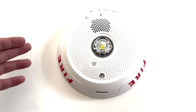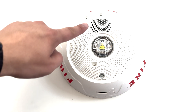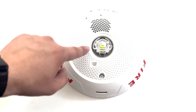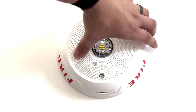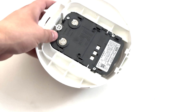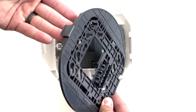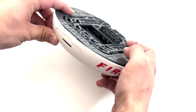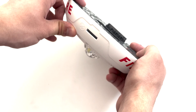We also have the white ceiling mount PC2W LED. It has all the same features and changes as the other two devices, but it may be my personal favorite design, where the round strobe fits really nicely in the round overall design of the device itself. The biggest difference between the ceiling mount and wall mount variants is on the mounting plates. The circular plate covers the entire device and includes an extra latching mechanism to easily install prior to screwing in. When removing the device, you'll need to unscrew the base first, then insert a flat-head screwdriver into the slot to pop it down.